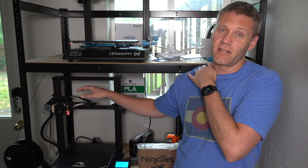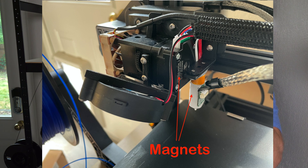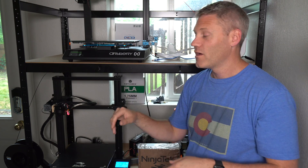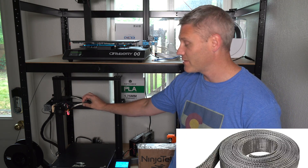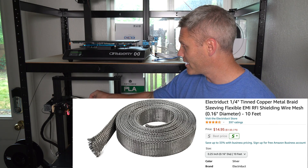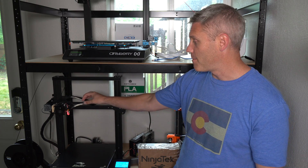When I initially installed the BL Touch I didn't have any issues. But when I swapped out the extruder to make it a direct drive extruder, my BL Touch started getting wonky and having issues. I think it was a couple of reasons: now that the extruder is right next to the BL Touch, the BL Touch operates with a magnet and there's a big magnet in the extruder — that's how the stepper motor works. So there was possible electrical interference with the wiring too. I solved it two ways: I flipped my BL Touch so the wires were on the outside, and I bought metal sleeving material to shield the BL Touch wiring. When I did that it worked and I didn't have any more issues. I'll put a link in the description for it.